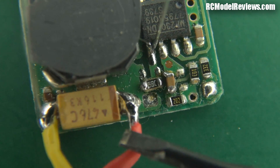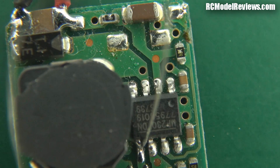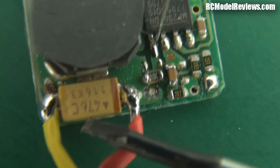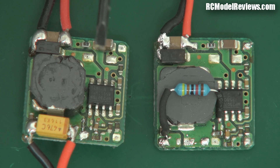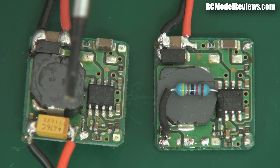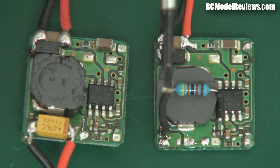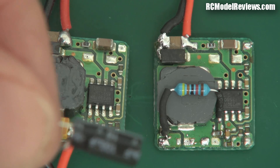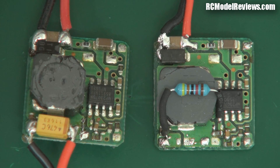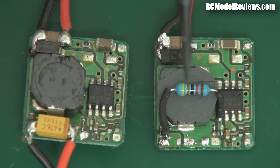That's how you can repurpose one of these little regulators to do things other than just drive RC gear — and there's not a lot to it. The soldering was awful so I re-soldered it. Now I'll use it for driving LED lights on my multi-rotor. This is the board after cutting the heat shrink off and separating the two boards. As I mentioned, those capacitors are probably only 6-volt rated, so I've pulled the capacitor off this one and put my resistor from this pin on the IC across to the negative, with heat shrink on the leg to prevent shorts. I'm replacing the tantalum with a 47-microfarad electrolytic, fitted between the positive and negative pads.